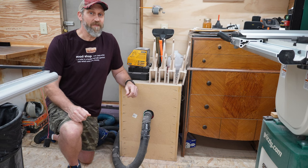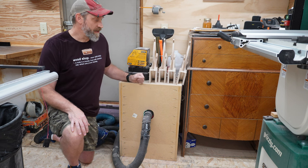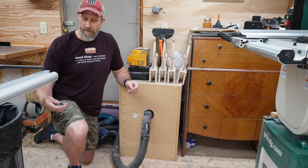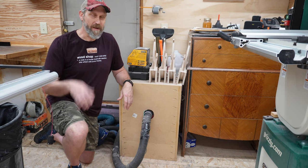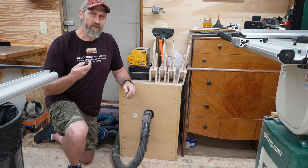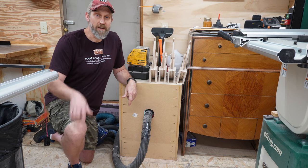This little guy over here is my shop vac, which is one of the noisiest machines in my shop. To control the noise coming from the shop vac, I built an MDF box and lined it with carpet and just set that over the top of it. That works pretty well actually — it operates on a remote. I can run this without hearing protection whereas I couldn't before. Usually I have this remote hanging from a drywall screw in the ceiling. I made two videos about this dust collector — I'll have links on screen and down in the description.